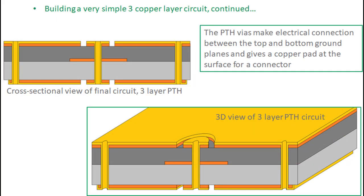This graphic is essentially the same as the last one but includes a 3D view so you can see how the circuit can be connected. If you place a vertical connector onto this circuit, the ground shroud of the connector makes contact with the ground plane, while the center pin makes contact with the via that goes down to the middle of the circuit, where the energy reaches the signal plane.